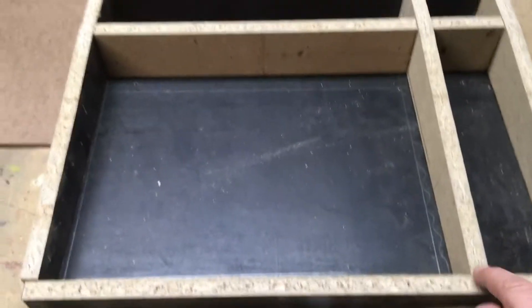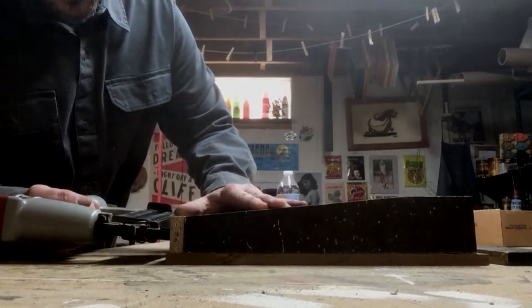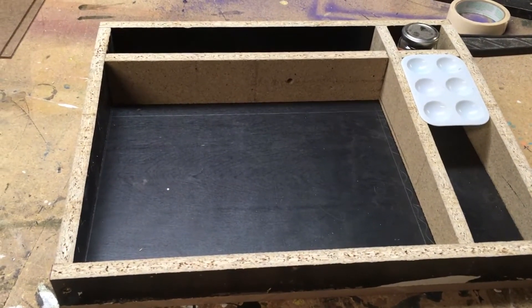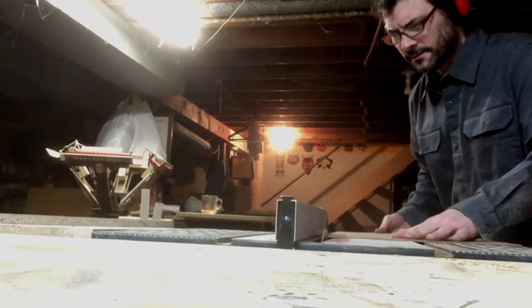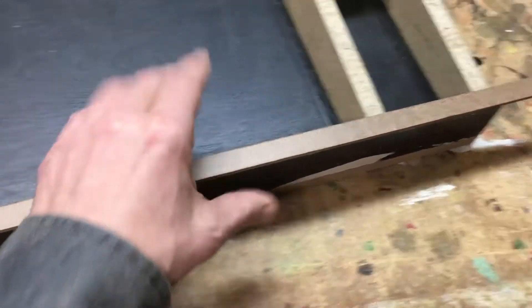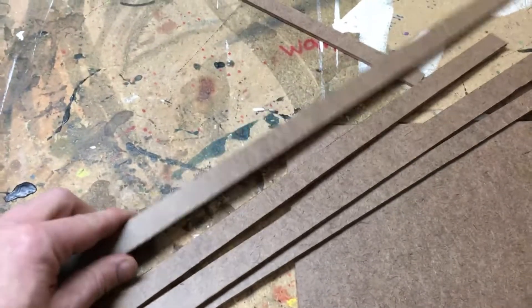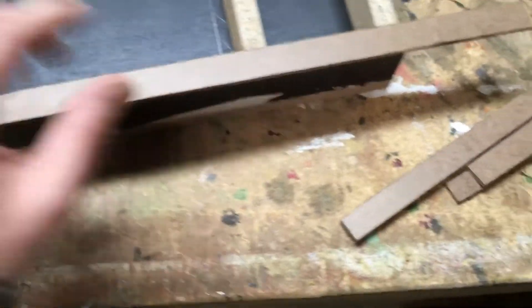All right, so what I need to concentrate on now is this space right here. We'll start with the corners — it's a good place to start. That worked. Right now I'm going to cut some veneer strips. I'm going to cut some to this thickness, and then I'll figure out all the math for all the sides after that. It'll probably be very smart to do a test first. Looks like a good width. There was a slight creep that happened on the fence because I didn't tighten it down very well, but I think in the end that might be beneficial because it allows a little bit of a lip to come over and I can join the sides a little nicer.